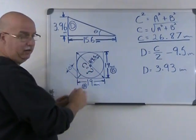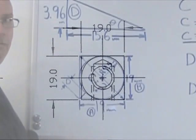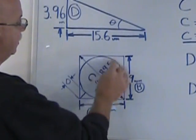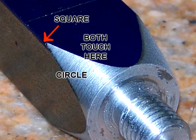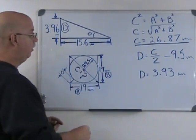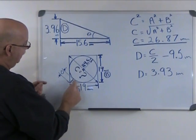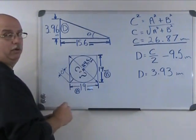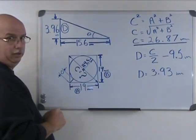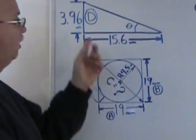So we'll start with what we have here. We're looking at our part on the end. We have our square section of 19 by 19 millimeters, and we have the radius of the center circle. This taper starts as a circle and ends as a square 15.6 millimeters further down. So the radius for this circle is 9.5, or if you prefer, half of 19 millimeters. What we need to find here is D, this little end, or if you prefer, the difference between the circle we want to start with and the square that we want to finish on. And the square is point to point. So D, this little end part, is what I need to find to be able to resolve this triangle